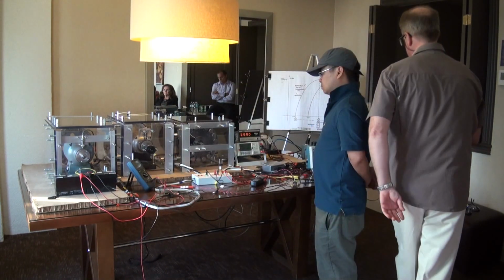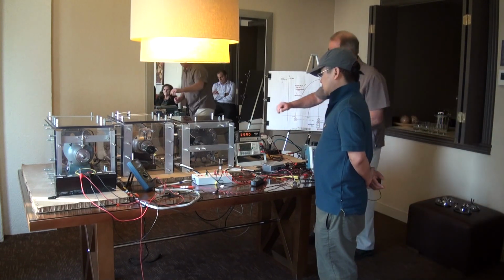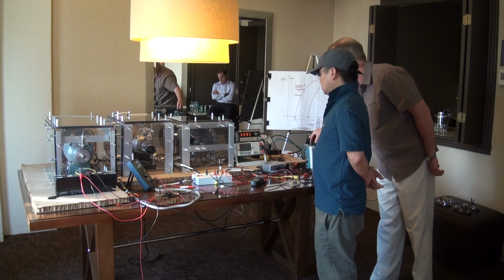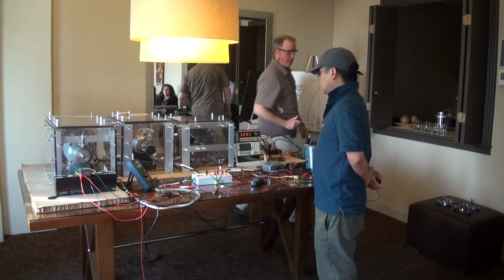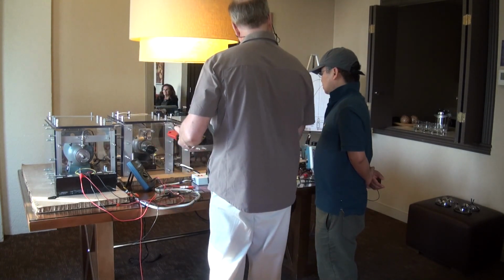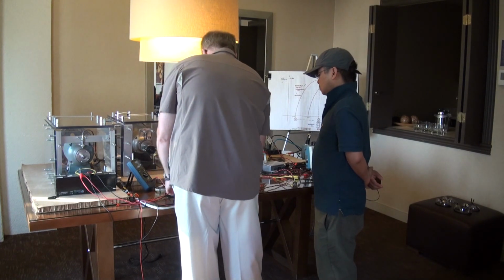So now I'm going to run the ReGenX coil that's in this prototype as a motor coil, and we will show you regenerative acceleration with the motor coil. Because the regenerative acceleration coil creates complementary electromotive torque rather than counter torque, it can be integrated into a motor coil and recharge the batteries while in pure motor mode without any deceleration of the system.